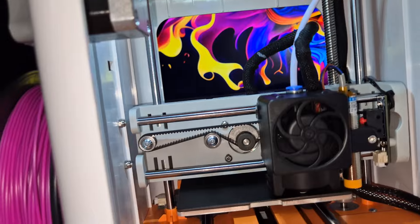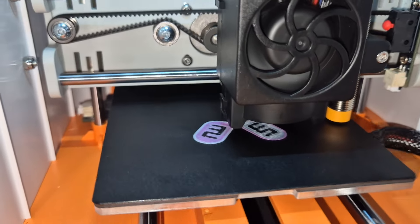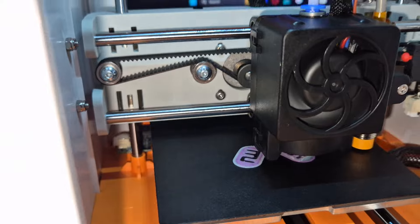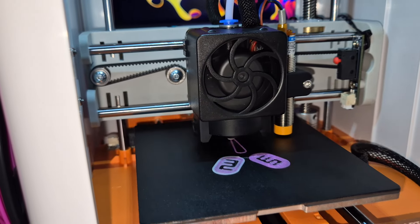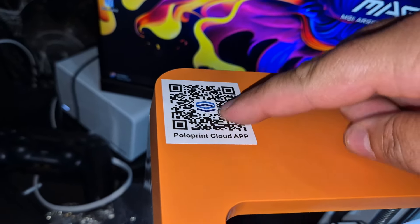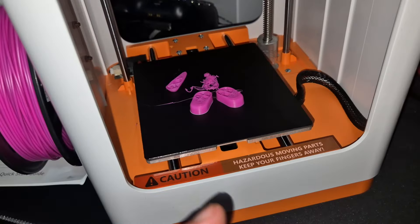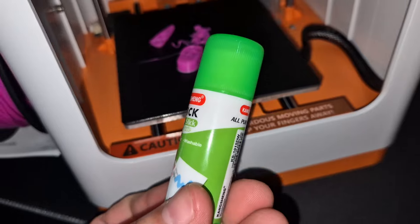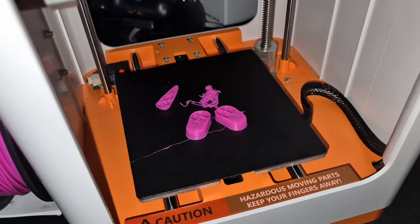It's going through the process of heating everything up. Printing is now in progress and this one takes about an hour. I just have to mention that you've got the PoloPrint Cloud app — if you scan this, you've also got support from Wi-Fi if you need it. This is the first time me using one of these, so I wanted to show you in reality if things go wrong. The reason they give you this glue is because, as you can see, it's gone wrong here — it needs to be stuck down. So if you run into a problem like this, you can stop it, rub the glue on this plate, and then start it again. The glue's on and off it goes again.